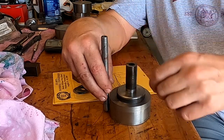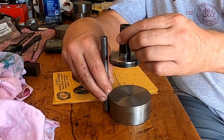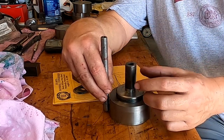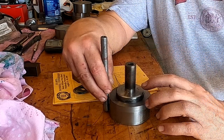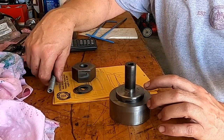This will allow me to raise it up over my pallet jack height. My pallet jack is three and a quarter inches, and it'll get it up over a four-inch block if need be, in case I need to put it in a crate. So it gives me the ability to move it, service it, and make sure I'm not having to bend over too much at the lathe.